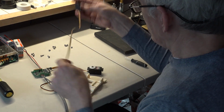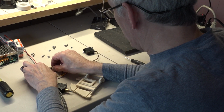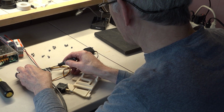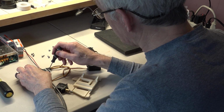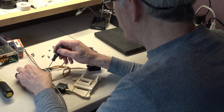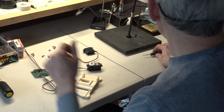And then your tilt servo. Same thing. Screws right up. Okay, the next 2 connectors, this one and this one, connectors 5 and 6, are for the eyes left and right and eyes up and down. And so we use only the first 6 on here, but these servo boards have 12 outputs. The other outputs could be used for other props.